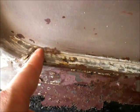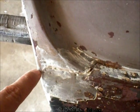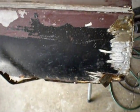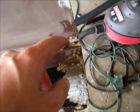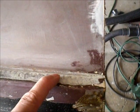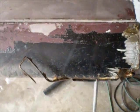And then I was trying to figure out how do I recreate this, but then I'll do exactly what this guy did, except he just tack welded over it. But I'll make a butt weld here, and then come straight across. I'll just recreate that. That shouldn't be too bad, I hope. And because it's on that corner, I'll just MIG weld it instead of gas welding. I'll recreate all this geometry from the template I have over there. So, alright, I'll get to it.